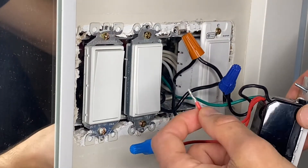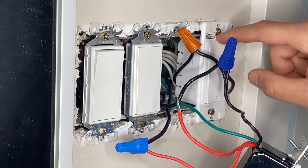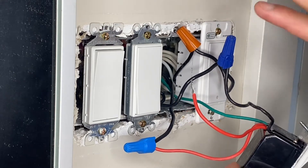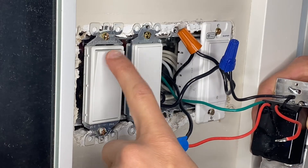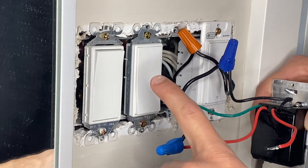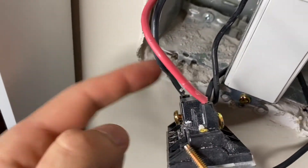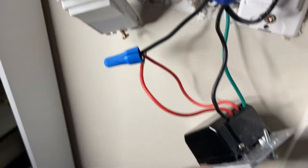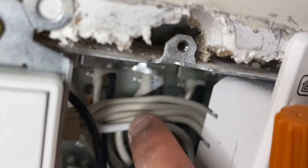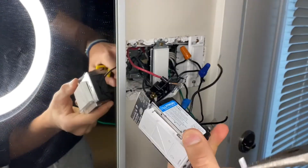When I pulled this out, there was a loose black wire. The black wire comes from this light switch into a wire nut and then feeds into the next switch. The green wire is grounded — that's correct, leave it alone. You don't need to touch the white neutral wires either. The red and black wires are connected to the switch on the other side of the kitchen. Now I'm removing the tabs on either side — note that doing this reduces the wattage rating for incandescent and halogen bulbs.